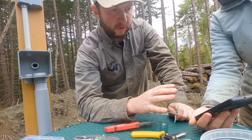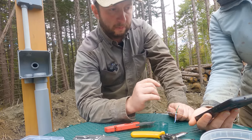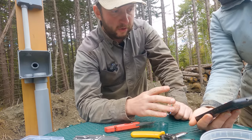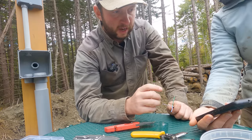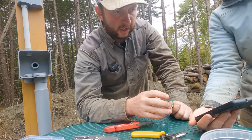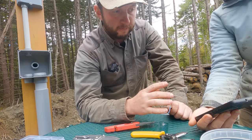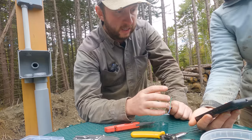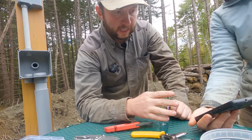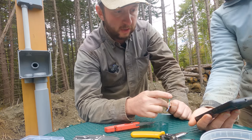This diagram, this model that we're using actually allows you to send not just the data, but separate 5-volt and 12-volt power down there. In this case, they put 5 volts on the orange, they put 12 volts on the brown, and they put data on the blue, saving an auxiliary ground for the green, or auxiliary 5 volts and ground on the green. So that means that we need the blue for data and the orange for voltage, basically. So I can cut away the green and the brown as not being used.